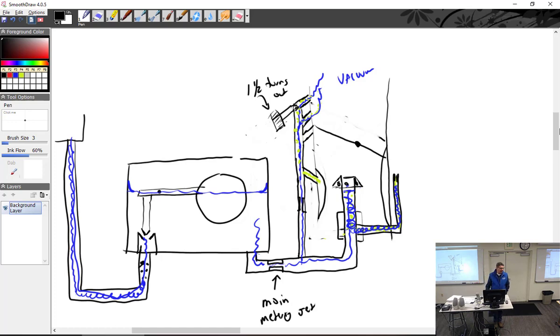All right, so the Stromberg is different than all of the other carburetors. The other carburetors are actually quite simple. There is a valve that is just put in line in series with the main metering jet. The main metering jet is really designed to limit the maximum amount of fuel that can flow at wide open throttle. Anything other than that is going to have less fuel flowing, and so it really doesn't restrict it as much, because that's just the way fluids work.